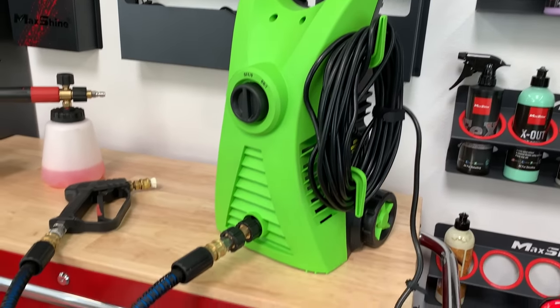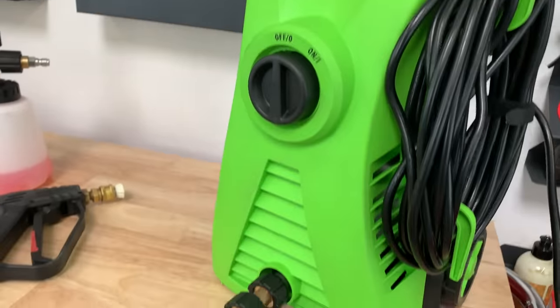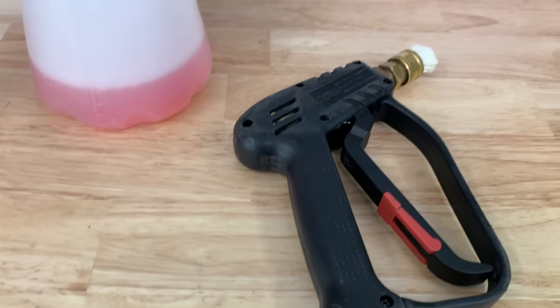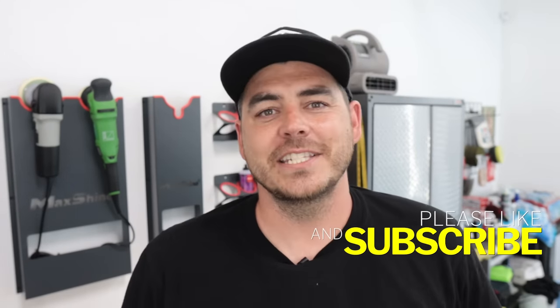That is basically it — a very simple setup. Water inlet comes in to the back, pressure washer on/off switch, runs down to the water outlet into a quick connect, down into my 50-foot pressure washer hose, another quick connect into my pressure washer wand, and then the tip. Really simple, effective, and cost-effective way to make your pressure washing experience 10 times better. I also did a whole video on the top five pressure washer upgrades — this is a reiteration of that, specifically showing you how to hook it all up in line so you can just plug and play. I hope that helps. Please like the video, make sure you're subscribed, turn on the notification bell, and we'll see you on the next one.